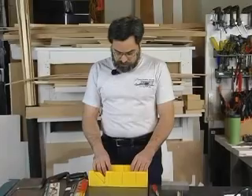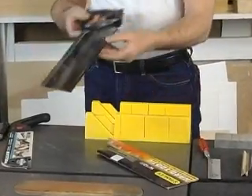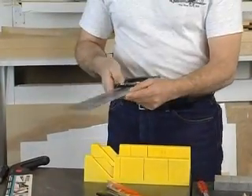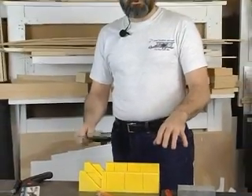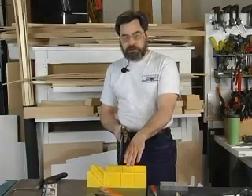Take for instance this inexpensive miter box. When you're working on an aircraft and you have a 24-foot-long wooden spar, you're not going to be able to bring that spar over to your table saw or band saw to make a cut. But you need to make very precise cuts on a regular basis once you get your spar to shape. One of the best ways to do it is to use a miter box and a good straight-cut saw blade like this one. You can set your spar right at the workbench, right where the aircraft is, and cut a very accurate crosscut on your spar.